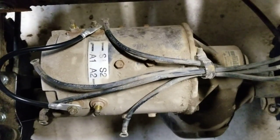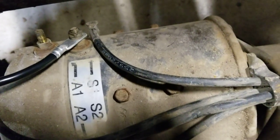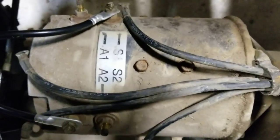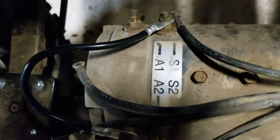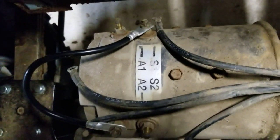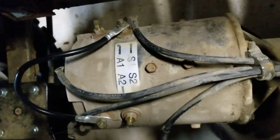Here's the motor, and you can see on the motor where it says a1, s1, a2, s2. Even on the cables it'll say what they are — at least on mine. If you don't have the lettering on there, go ahead and tape it and write it down with marker so you can remember to hook them up correctly.